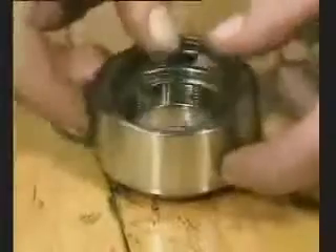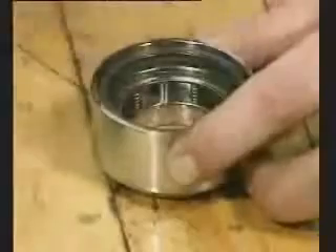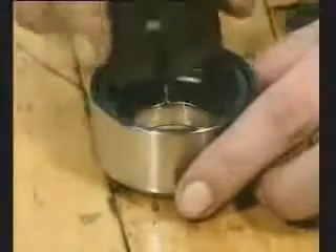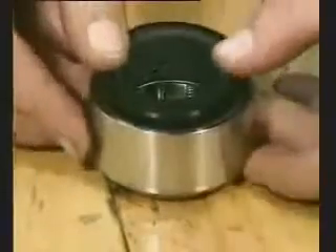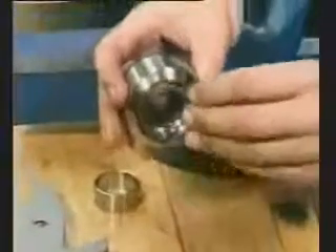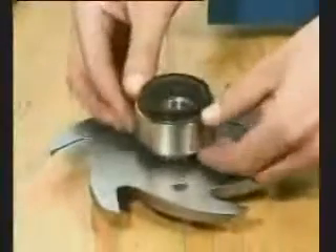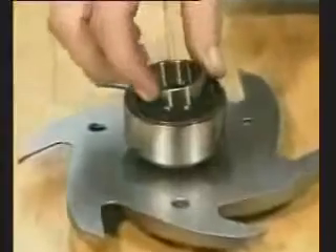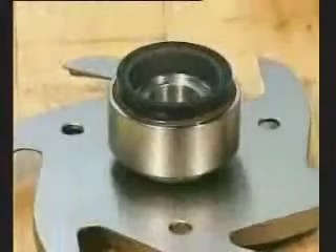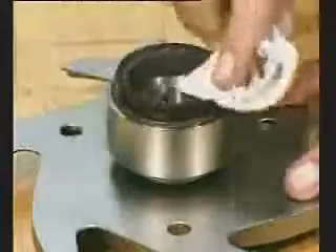Be careful when assembling the rotating parts. Ensure that the two drive pins enter the notches in the rotating seal ring. Place the quad ring in the rotating part and mount it on the impeller hub.